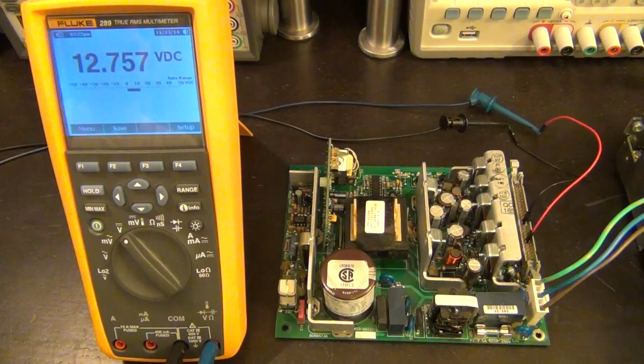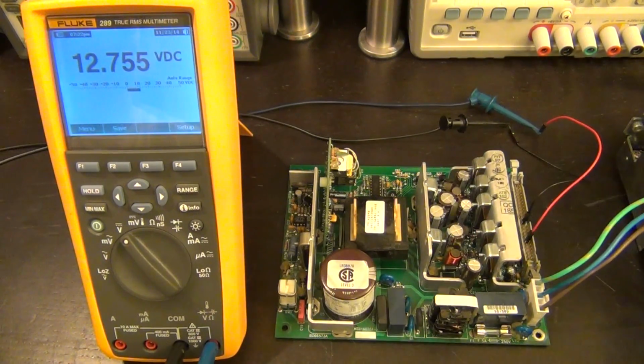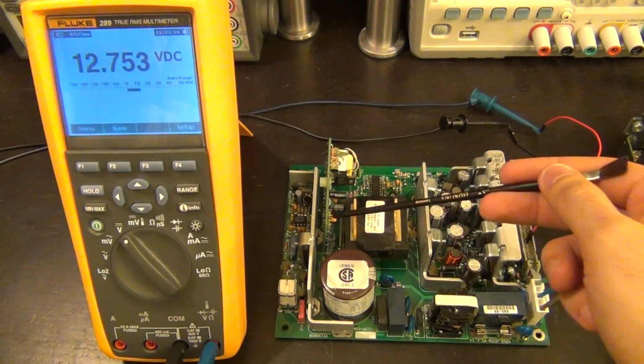That's frustrating. So I did exactly the same test I did before. I connected it to the ribbon cable, and you can see that VC 12 volt. This is the same test I did at the beginning when it was still connected to the main motherboard. So it still works, and so the only thing I'm left to judge is that something I did mechanically fixed it. Maybe because this board was loose.